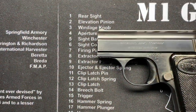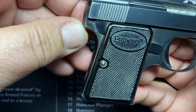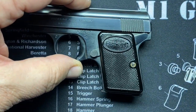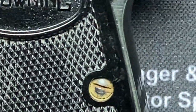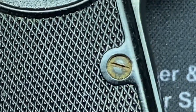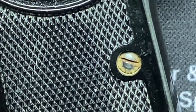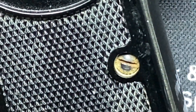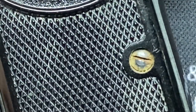Looking really close, this thing is pretty minty right as I purchased it. But when you put a collector's-grade eye on it, you start to see things. That screw slot is unacceptable — we've got to clean that up. The amateur is just going to shove a screwdriver into that three-quarters-filled-up slot, slip out of the screw head, and take a chunk out of the screw. Before any disassembly, it's really important to go over it carefully.